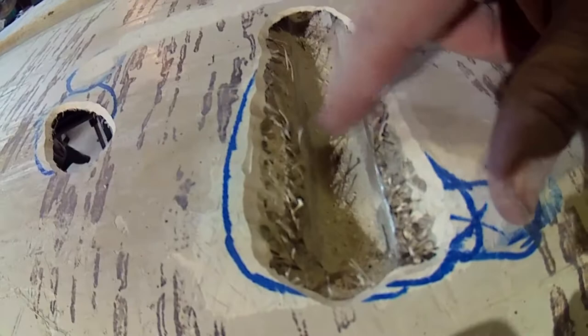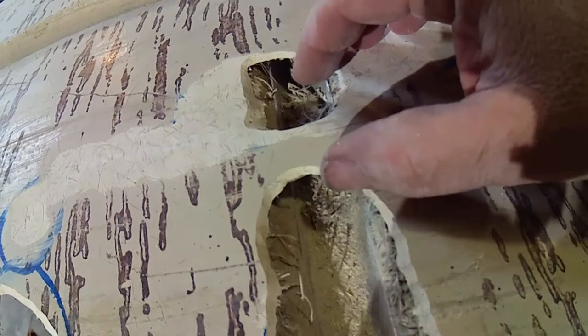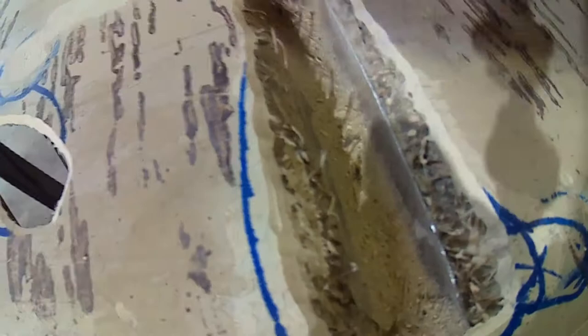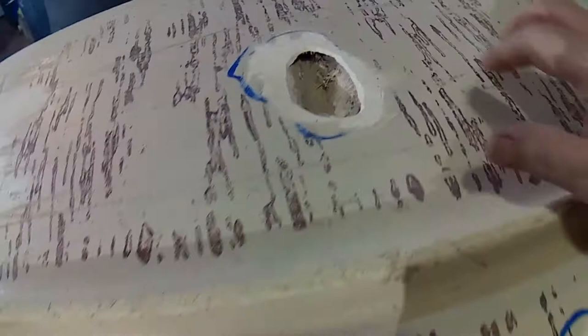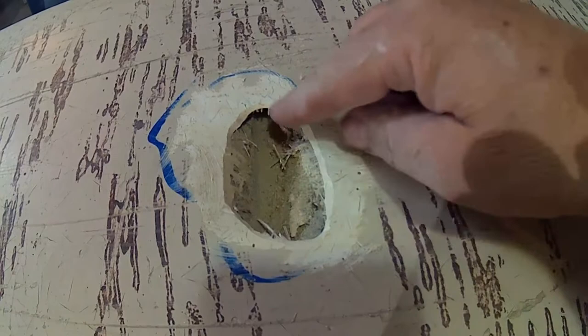Solid canoe. There's an aluminum channel down in there, and we managed to save this much. Now, it might not make a hill of beans to take that out or leave it, but I think for this repair, I'm just gonna leave it. So we'll get this all suctioned out with the hose. This turned out to be okay. This is pretty solid. Other than the surface cracks, I couldn't find any issues right here. Same thing back here. So this hole opened up pretty nice. Got another aluminum channel in there. We got good contact here, so we'll be able to do that repair pretty easy.